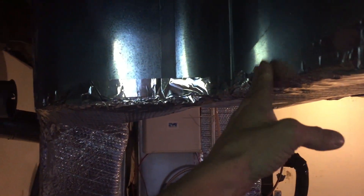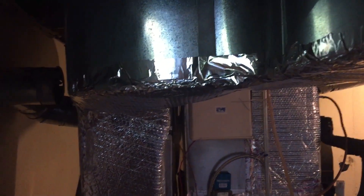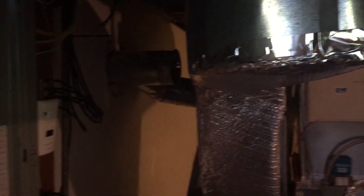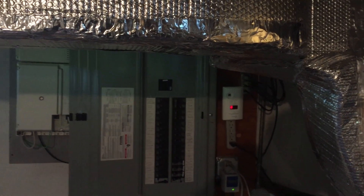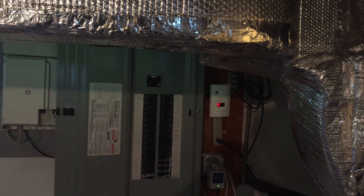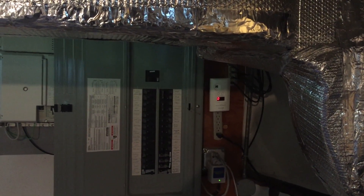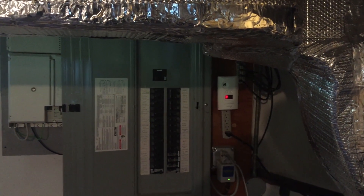But as you can see, you're going to be ducking under this or bonking your head off of that trying to work on it. And you definitely don't want to be doing that when you're working in an energized panel. It's going to be really difficult and dangerous to try to get in there and work safely. So again, this is a violation of the working space requirements in 110.26A1. We need at least three feet of clear space depth in front of this panel board.